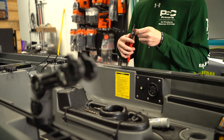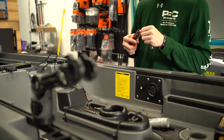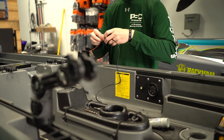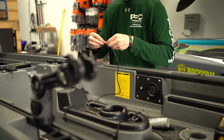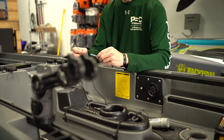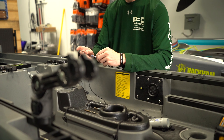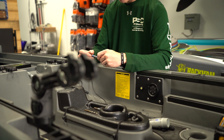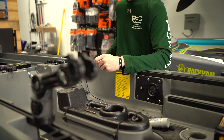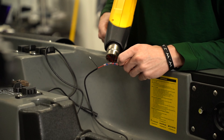Now we're setting up the fish finder power wire with a Yak Power plug. As you can see — we've hit on this before and we'll hit on it again — we're using the heat shrink solder connections that we have on the website, as well as some heat shrink tubing. This allows us to have a super clean install and it prevents corrosion because everything's super watertight. The wires are soldered together, so you never have to worry about salt, water, or humidity getting in there and ruining your wire setup. Since we've started using this, I've never had issues with corrosion like we did when we used crimp connections.